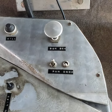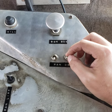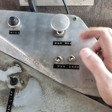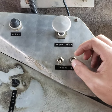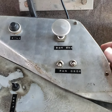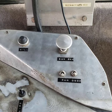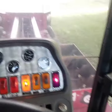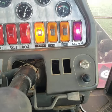The other switch right beside it — this one I added myself because it wasn't in here before, and I got the idea from other sleds I've seen with it. This is a push-down switch. This activates the down-pressure push-down system on the back of the pan — that's the system with the hydraulic accumulator up front. When the box tops, it actually puts pressure on the back of the pan to the bottom of the frame rails. A lot of times when you see a stop, you'll see the back of the sled up in the air with all the tires hanging there spinning. We hit that and you'll see we've raised the front of the pan off the ground probably six or eight inches, and now both yellow lights are off.